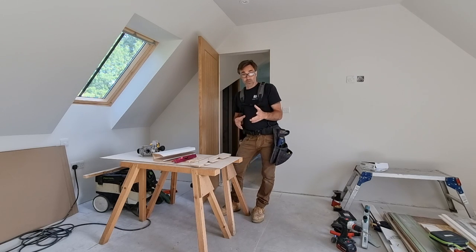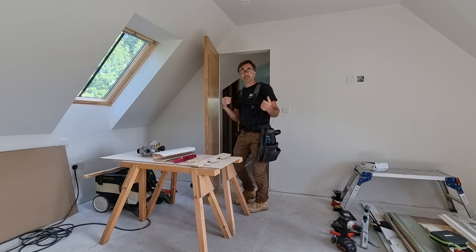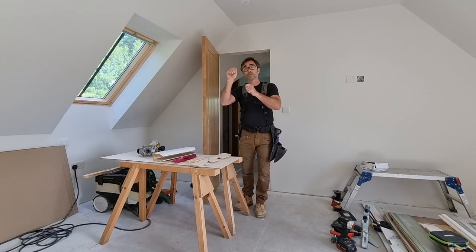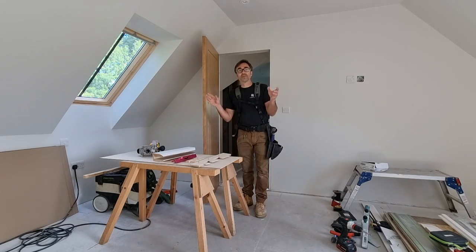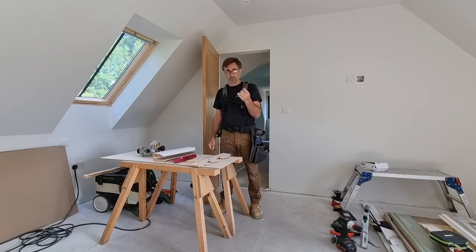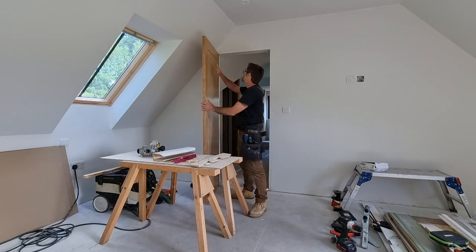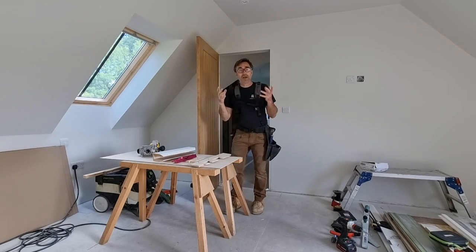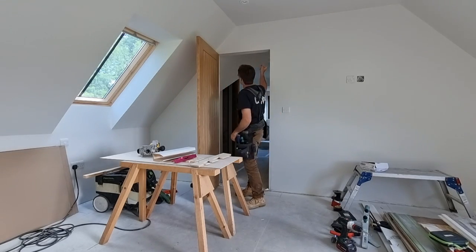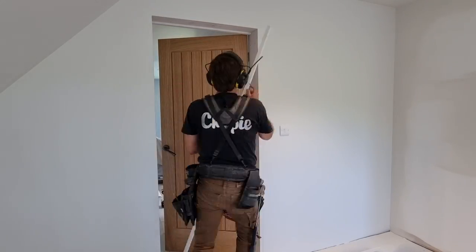Now we need to fit the door stops — the bit that holds the door in the lining. I like to fit them once the lock and latches are in, because it's then a one-person job. I pull the door to click it on the latch and go around with the stops. We cut the stops to length and they've been primed and knotted, so they're not going in bare. I like to use a thick credit card — the embossed kind — because it gives just the right amount of paint gap between the door face and the door stop. First put in the head, making sure it's not pushing the door out, then the closing side where the latch is, then the last one.